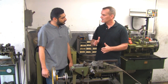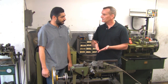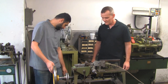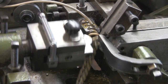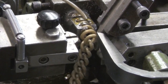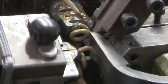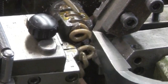Are these the same types of chains that would go to any type of product like jewelry, handbags, or other types of accessories? Whatever it may be. Can you show us how the machine operates? Absolutely. So it looks like we're getting a loop through a twist that's now getting cut off. Right — wire feeds through what's called a spiral. The spiral actually forms the shape of the link. The link is fed into where the jaws are; the jaws first cut it, then the jaws twist, and that's what finishes the chain.